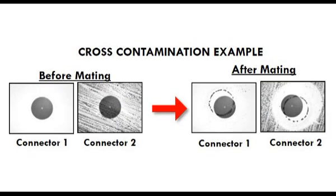When cleaning fiber optic connectors, make sure you clean both ends of the connector pair. If you only clean one end — for example, just your jumper — residue like alcohol, water, or moisture from an outside plant pedestal can transfer, and you'll see a coffee ring stain on both ends when you inspect them. Also, avoid plugging connectors in and skipping inspection and cleaning to fix it retroactively. If dust gets between the ferrules, the spring force is very tight and will embed debris into the glass and ceramic, causing permanent damage or scratches. Take a few extra seconds to inspect each end-face, clean if needed, do both ends, then mate them. This extends connector life and ensures the optical performance you expect from your interconnects.